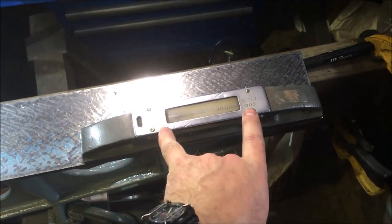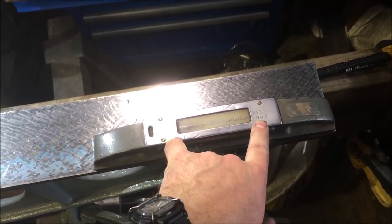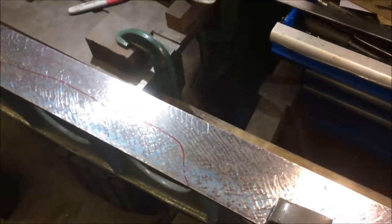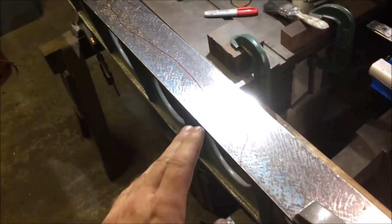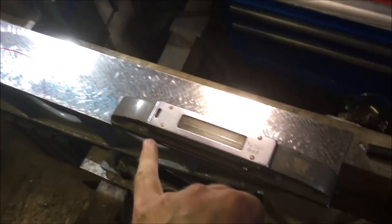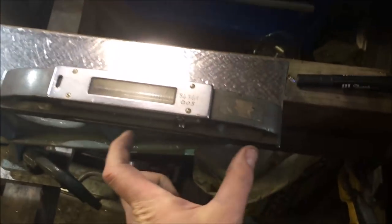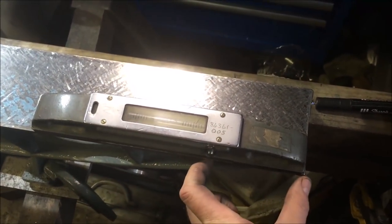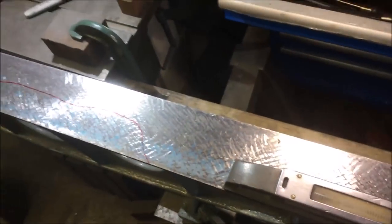And that's 2/10 over the full length of the spirit level. So bearing in mind, I'm only taking a quarter of that, or a third of it, let's say. It's a third of 2/10, i.e. less than a 10th. So I don't think there's a huge amount of twist in it, but nevertheless, I'm getting this odd pattern. So I've then put the spirit level on again, and I've gone down it, stepping it down, putting its feet so they overlap. So that one then moves to that position, and we take the next measurement.